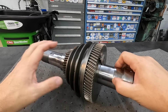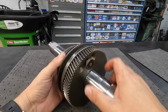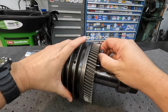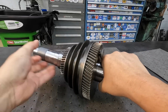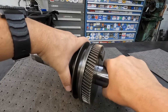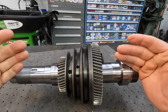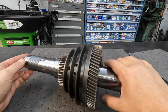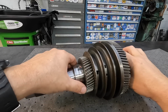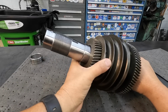So what you have is you got this little pin right here, and if you pull this, drop it in, all right, the pulley, it drops in. There's a couple counter bores on here that we got the pin pulled, and then if we drop it in, there it goes, it drops into place. So you can put it, I'm not sure if that's in or out of back gear exactly, but just showing you how it works. So got this collar loose, I guess that just holds it in place against this gear. We'll take that off, and then the pulley will come off here.